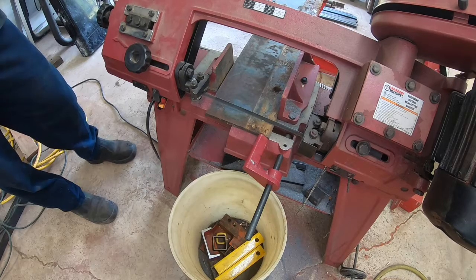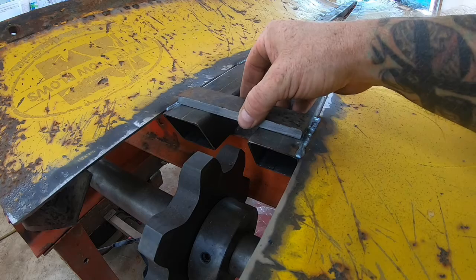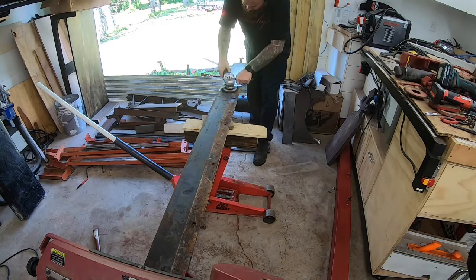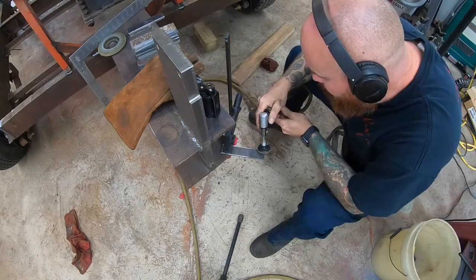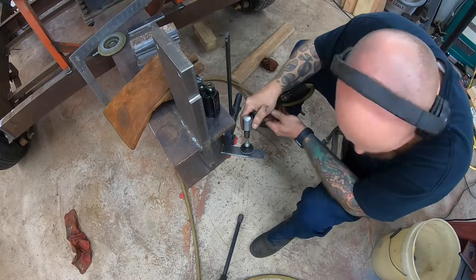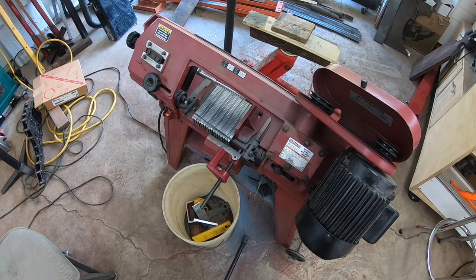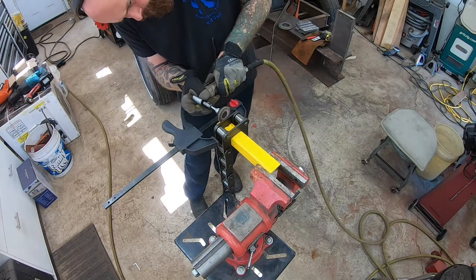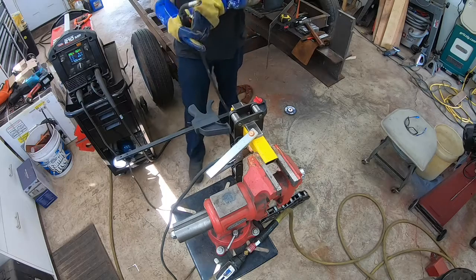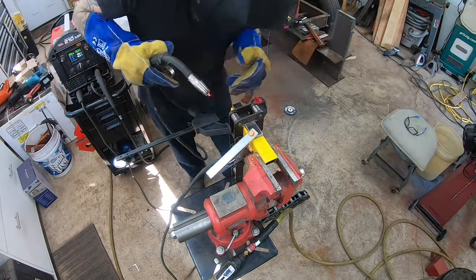This is the cutting edge off that 7-foot plow. I think it's 3/8 inch. It was a little over 6 inches long, so I decided that's what I was going to use for my cleats on the chain. I cut them to 1.25 inches wide and 5.5 inches long. I welded 8 to each of my 10-foot chains. I basically skipped 2 links in between each cleat.